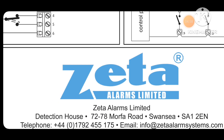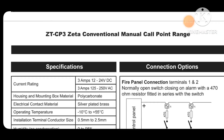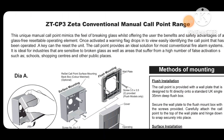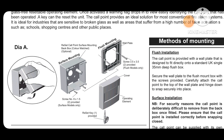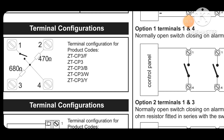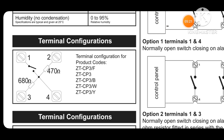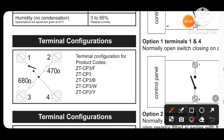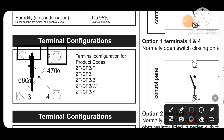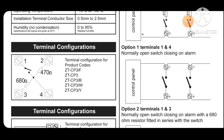This video was on demand — one of my subscribers asked me how to connect the conventional manual call point in Zeta, because when I did it the first time it was confusing for me too. Generally I only connect terminal number 1 and 2: red on 1, black on 2. For the next device also put red on 1, black on 2. If it is the last device, just connect the end-of-line diode here.